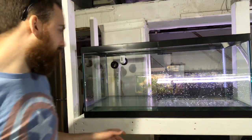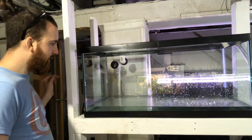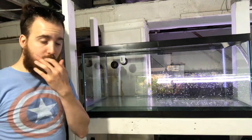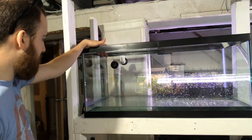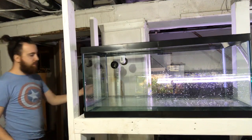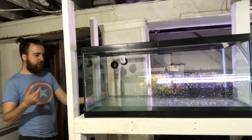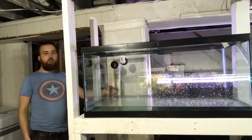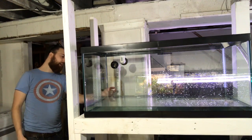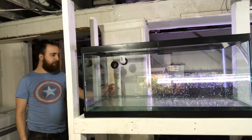So I was considering putting a drain valve at the bottom of the tanks. It's still a possibility, I could still do it. I just haven't decided if I want to. Basically what I would do then is just a bulkhead. I could even do a 3/4 one. I don't necessarily have to do 1 inch because this is just to drain it. But essentially I could do that, right? Drill it and then have it line up with the existing pipe here.